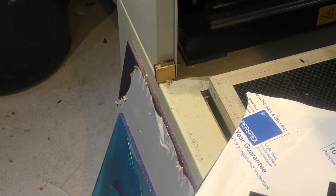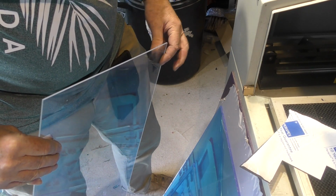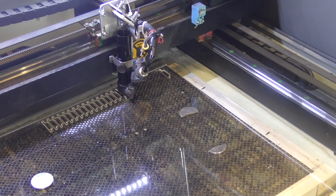Now, I've got lots of bits of acrylic in this workshop which I've searched through. I've got a lovely sheet here, and here we are in this corner here, 2.98. Snug, but nice fit. This corner here, 2.99. So this looks like a perfect piece of material. All right, I'm now going to literally just turn it upside down and look at the other corners a metre away. 2.5 and 2.7. I mean, this is absolutely ridiculous. So even though there's no labels on it, this is a piece of cast acrylic with such a large tolerance. So if I work across this top edge of the material here, I probably will be able to get the size tenons that I want.